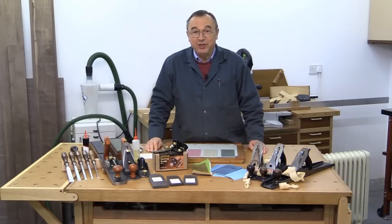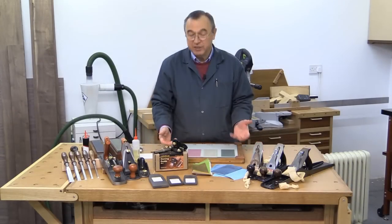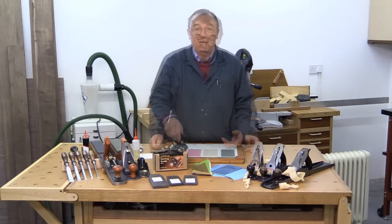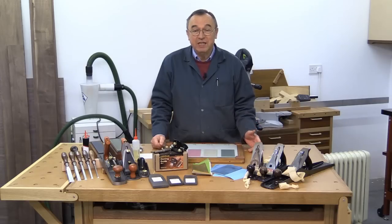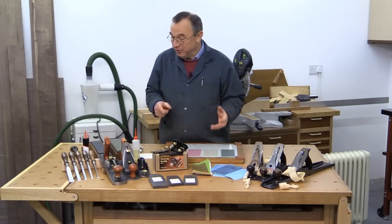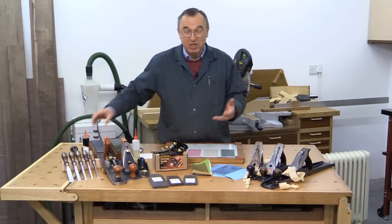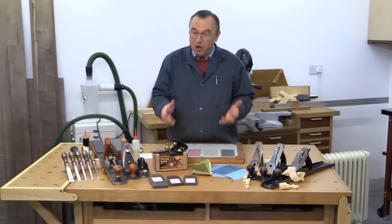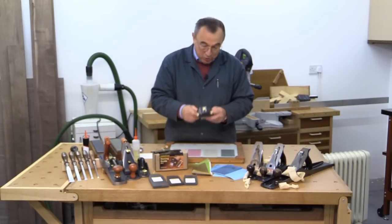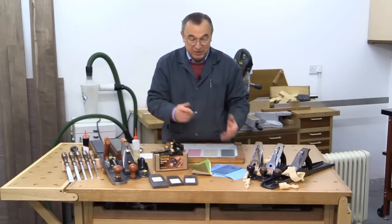Well, I hope over these two videos I've given you a reasonable insight into the world of lapping. Well, I certainly know what the future is for me to be able to look after my lovely planes from Veritas. For me, I'm getting rid of that waterstone and I'm going to stick with this for the future. If I've got a primary bevel that needs a lot of serious attention, I'll either use my old carborundum stone or some very coarse lapping film. But the star of all of this, to be honest, is the honing guide from Veritas. Without this, you can't get the smoothness and the accuracy that you need to be really good at this technique.